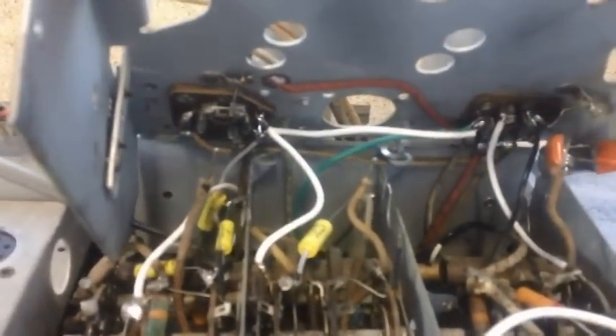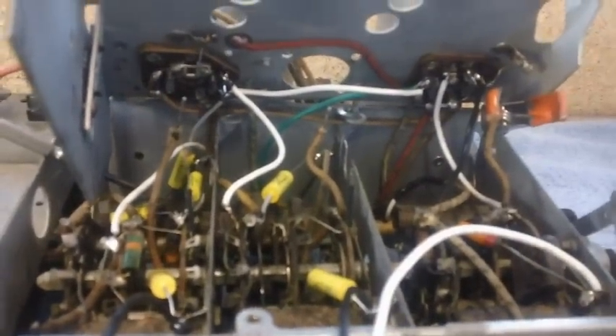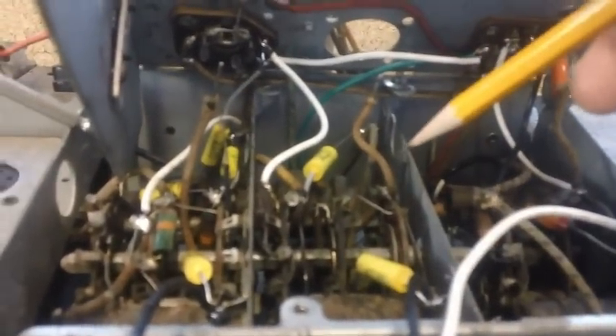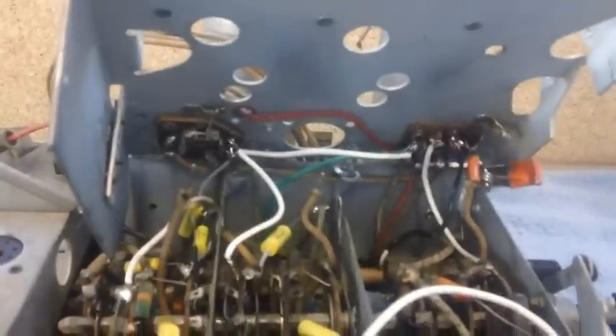This little grounding wire is very short, and if I don't hit the hole straight on, I've got a problem. So I'm going to tack solder a little wire onto it, feed it up through the hole, and then pull it through and unsolder the wire once it gets up through. The worst thing that can happen is to close the lid and have all these little wires miss the hole and smash down — then you've got to open it all back up again. We'll show you how to do that later.